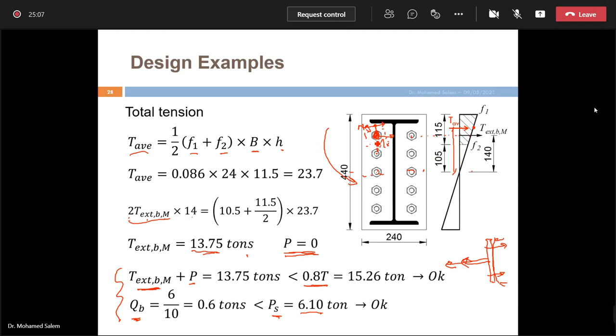In part two of the question: F2 was calculated at distance 105 mm. We chose the two bolts to check safety and they are responsible for the zone between themselves and the adjacent bolt. F2 is located at the centerline between the bolt being checked and the next one, measured to the centroid of the connection — that's where the 105 mm comes from.